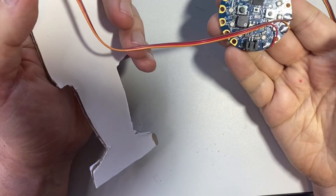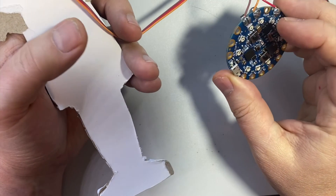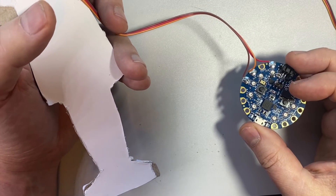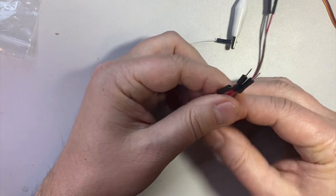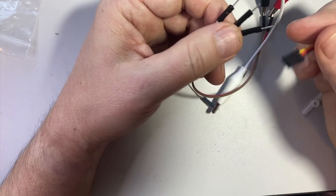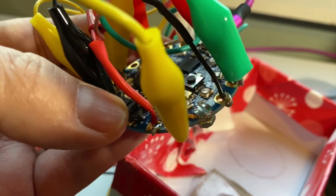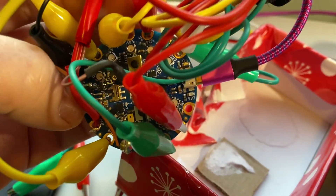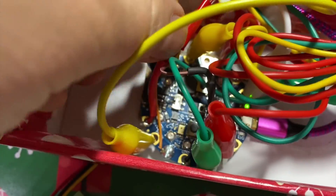I cut the connector ends off the servo wires, separated them, stripped the ends, and used bolts to attach them to the CPB. I did eventually solder these wires on because I take the lid off frequently to show students how it's put together, but it works just fine with the bolt-on no-solder method. If you didn't want to clip the connector off your servo, you could take three wires with pins, plug them into the holes in the servo connector, and clip the other ends to alligator clips. The diagrams are useful because everything looks cluttered when clipped on. Make sure your micro USB is plugged into the CPB as well, as that drives power.